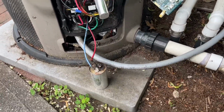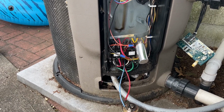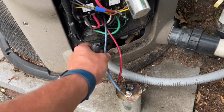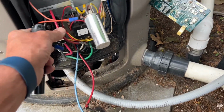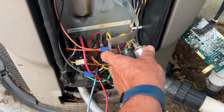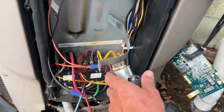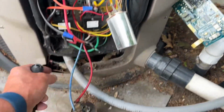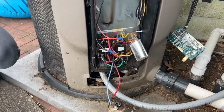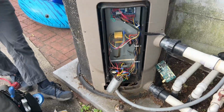All right. Now, let's try to patch her up together. This is our common. That's our common. And this is a common. Those two will go to fan, and these two go to Herm. Let's take a picture of that before I mess it all up. Think I did it right? We'll see if this works. It's not too complicated. Just stop at the green, not in between.